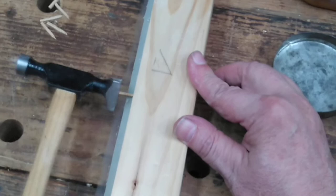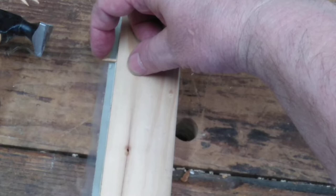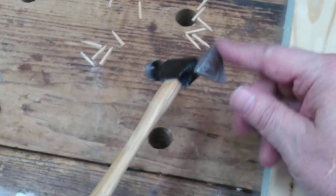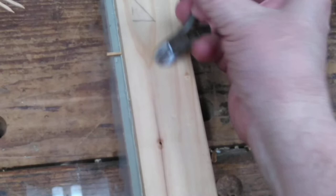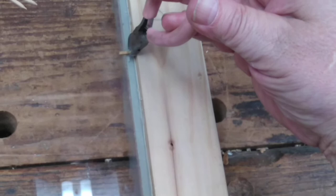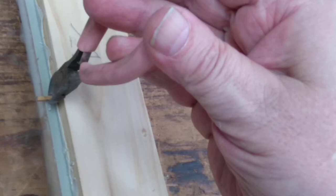They're made out of hard maple, so they're sturdy enough to just tap right in with your glazer's hammer or a big heavy chisel. And then, what I find works especially well is to use a pair of diagonal cutters, and you can just clip it off. So it's sticking out just the right amount. Wooden shoe pegs.